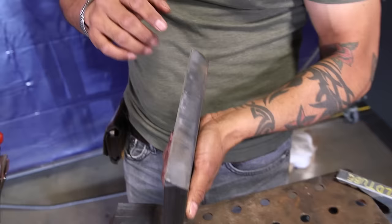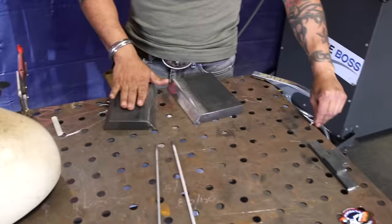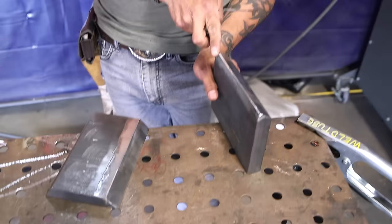Now be very careful because you don't wanna have too much of a landing. Remember, you're welding on a thick plate. You're welding on an inch plate and it holds a lot of heat. I went ahead and got my spacer. It's a 7018 3/32. Get rid of the flux, bend it, and this is what you're gonna use as a spacer. So always check your landing and make sure that you have a good 3/32 landing all the way around